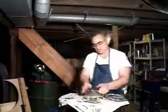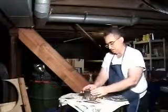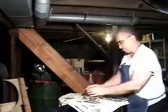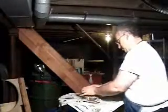And when I do this, I just resume polishing as I had with the flat on top, only this time I have the pitch lap on top. Back and forth — it's been in perfect contact all day for the last 24 hours since I stopped last night. I'm ready.